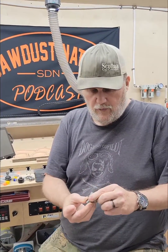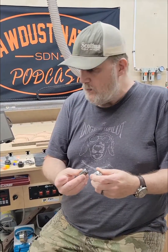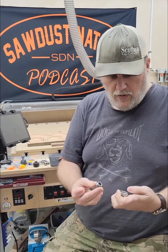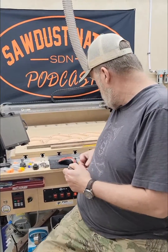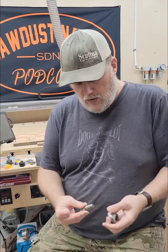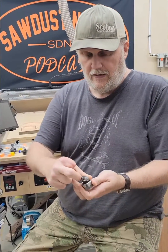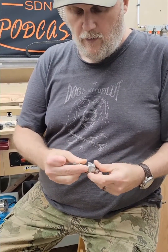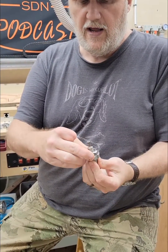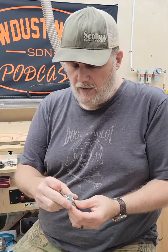Hello, this is Clint. I'm just going to make a short little video here. People are sometimes having trouble — they're used to using trim routers and they just put the collet and nut in just like they would with a trim router: stick their bit in and tighten it down. If you do that, it's going to seize the nut onto the spindle shaft and it'll be very difficult to get it loose.